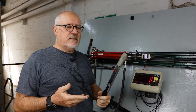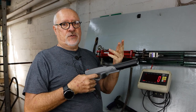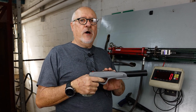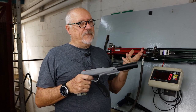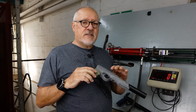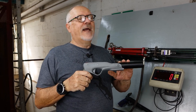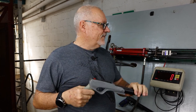The reason for this is if it destructs when loading, this sharp edge is going to hurt you — it could concuss you, and the last thing you want in the water is to be concussed, which can lead to tragic circumstances. This is a massive overkill in our opinion, but we'd rather have overkill in structural strength. If you're loading a 20mm band, the best case you'll pull is about 90 kilos, so we're hoping to get at least two and a half times stronger. Everything is overbuilt on purpose.